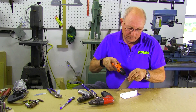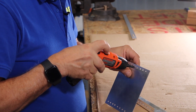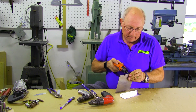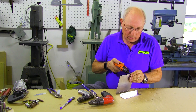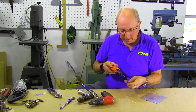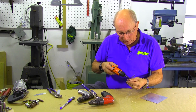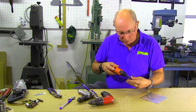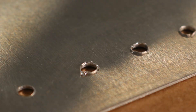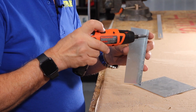Deburring is very tedious and takes a lot of time. Many people will drill up an entire structure, then take it all apart, and sit in front of the TV deburring all the holes — you can take plenty of time to do that. It's not something that takes a lot of thought or attention. But you want to make sure that you don't over-deburr; you don't want to countersink your holes, you just want to get those burrs off so the mating surfaces sit nice and tight and when you run your fingers down the line of holes, you don't cut yourself.